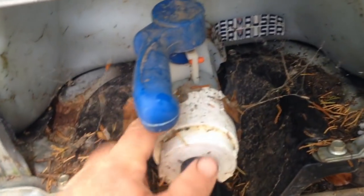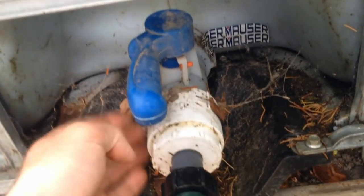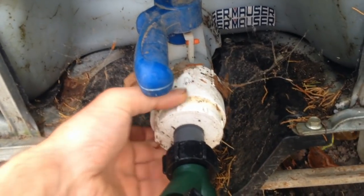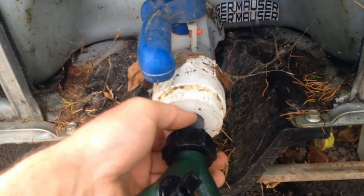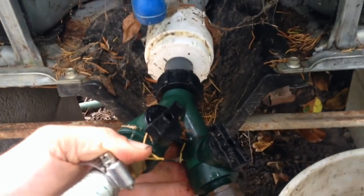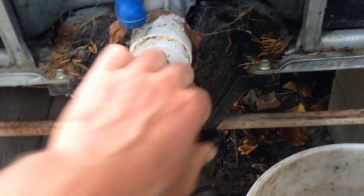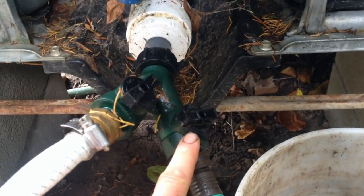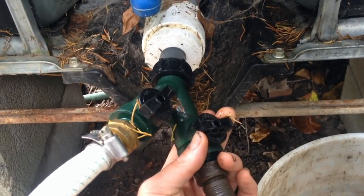The fittings on the bottom, I probably will do another video at some point that goes into more detail, but it's a 2-inch threaded diameter, or a male threaded fitting on these bungs. So I have 2-inch threaded PVC that goes to a shaft that is a 2-inch PVC to 3/4 inch MPT threading, which gets me to standard garden hose. And in our case, this one turns on or off. That's the hose that was delivering over to that galvanized tub that was overflowing and feeding the greenhouse.